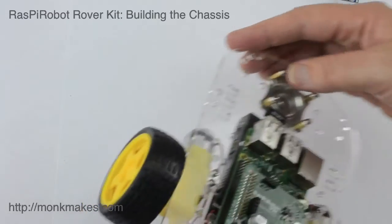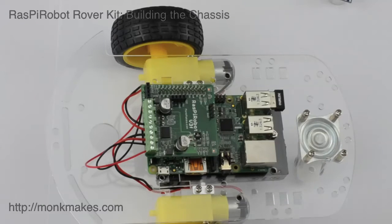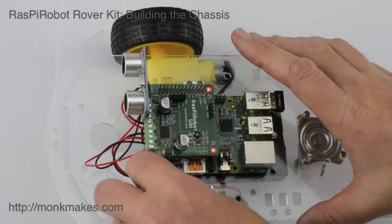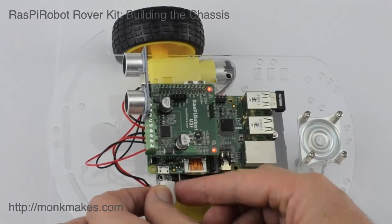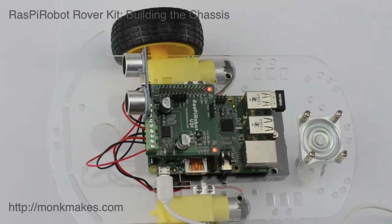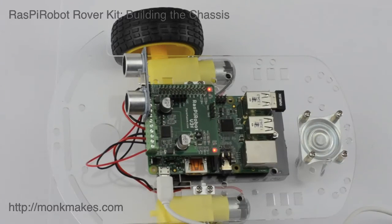The Raspberry Pi is starting to boot up, and once it's up we'll be able to connect to it over SSH via the Wi-Fi dongle. You'll find this eats batteries fairly quickly — they should last a few hours but it can disappear surprisingly fast. There's no problem plugging a USB power supply into the Raspberry Pi as well as powering from batteries on robot board version 3 — earlier versions didn't support this. You can even run purely on USB power, though the motor driver and open collector outputs won't be available. Just while testing, writing programs, and setting things up, using USB power will save an awful lot of batteries.